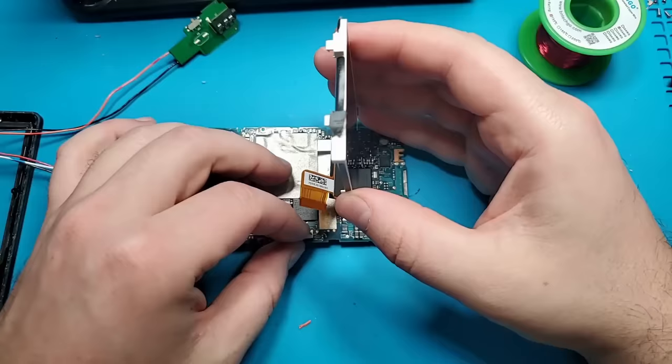Let's go ahead and test out the wireless charging. The Zune's charging icon will not indicate that the device is charging unless there is something plugged in. I can verify the wireless charging is working using the status light on my wireless charger here. Another way to verify that wireless charging is functioning is by powering the Zune down and allowing the wireless charger to turn it on, just as the Zune would turn on if it is plugged in.